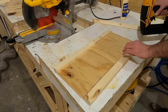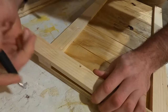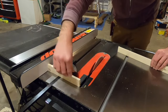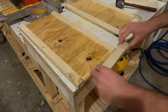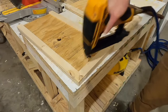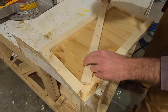I put a little glue down and attached these with one-inch brad nails, which should hold everything together securely. Try to line up the outside of the strips exactly with the panel, because any inconsistency will throw off the next measurement. I then overlapped another trim piece, traced the difference to mark where the board needed to be cut, set the fence to that length, and cut eight pieces. After the side frame pieces are cut, put glue down, place them, and attach with brad nails. One useful trick is to angle the brad nailer inward slightly so that if the brad nail springs out it goes into the panel rather than out the side.